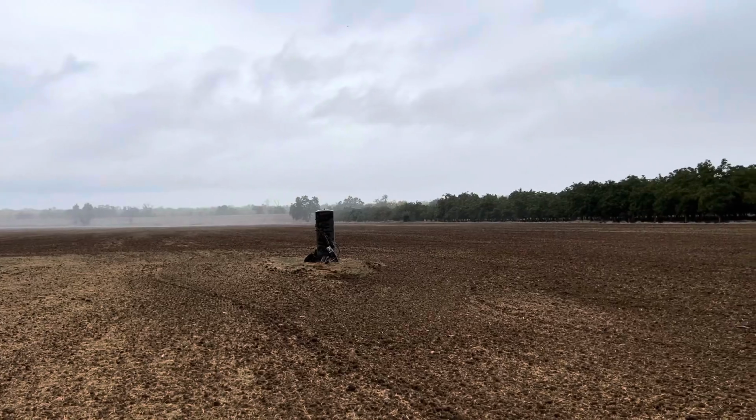Most any groundwork operation that smooths the ground out, floating, triplaning, leveling, anything like that, you kind of need the ground dry so that it flows through the bucket. If the ground is wet, then it has a tendency to clump up and it doesn't flow. I don't know how else to explain it, but it won't flow through the bottom of that blade. You'll end up making a bunch of streaks out here instead of leveling things out and making them look nice.